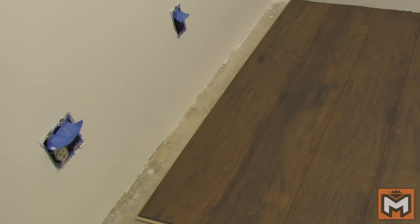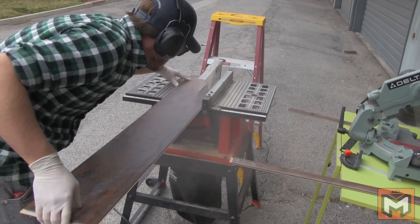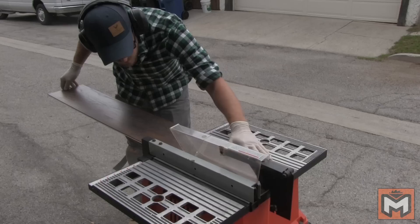In this case I'm working in a pretty small rectangular room, but I can see that if I lay it out without making any initial cuts, I'll only have a small strip of flooring on the far wall, which I don't want. So to split the difference, I can rip the first few pieces of the flooring from the tongue side by a few inches, and that will give me an even sized piece against each wall. Make sure you rip from the tongue side and not the groove side of the flooring when making your rip cuts.